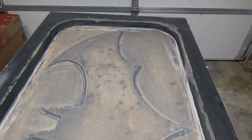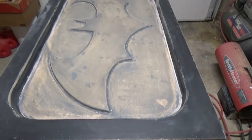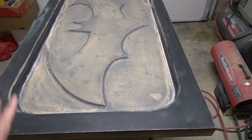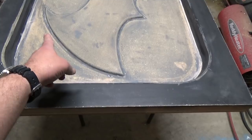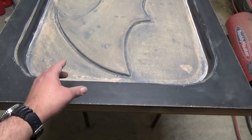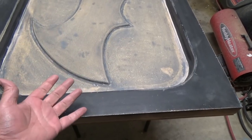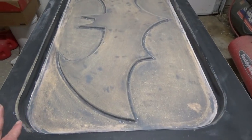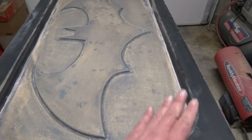This no longer has gel coat on it — matter of fact, it no longer has primer on it and it looks sort of bad right now, but it's salvageable, and that's the good part. Right along this area, the gel coat lifted and I pushed it down and broke it, and that's when I realized it stuck to the paint underneath. I tried to blow air under it and some of it came off, but it also peeled off some paint. Literally I scraped everything down to the wood and sanded everything smooth.